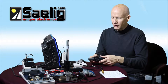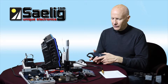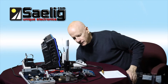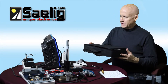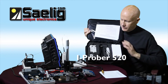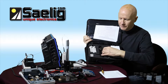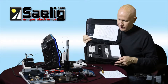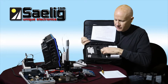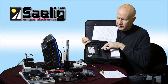What I'd like to concentrate on is a very novel piece of equipment that we have here, also from England, and it's made by TTI Company. It's a unit called the iProber 520. Instead of using a transformer principle, it has a device called a flux gate magnetometer, and the flux gate magnetometer is actually embedded in the probe tip of this unit, which you see in black.